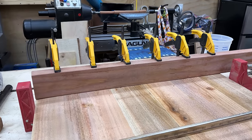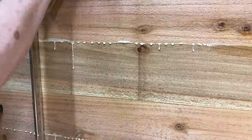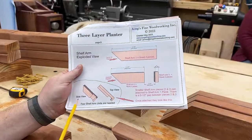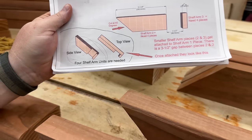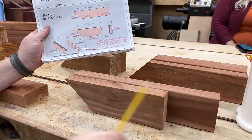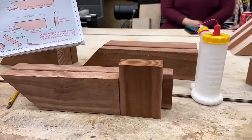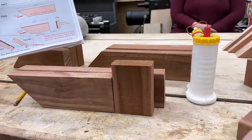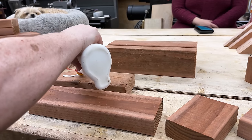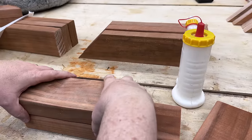The glued panels are all clamped up with squeeze clamps to keep them flat, and we wipe off the excess glue before it sets. Then we move on to assembling the legs. I'm double-checking the orientation of the shelf arm: long piece in the back, short piece in the front, with a cross lap joint here. I'll glue these up — probably not necessary, but a little extra glue will help this project last forever outdoors.